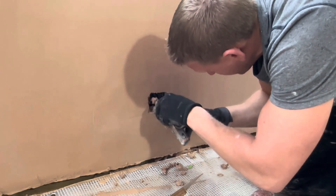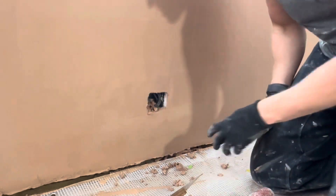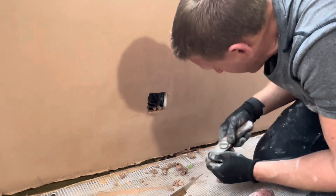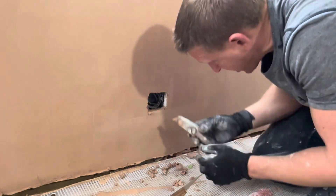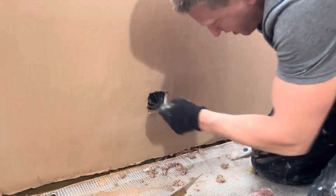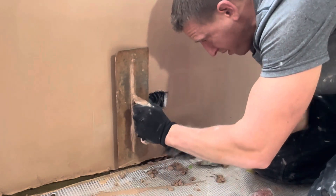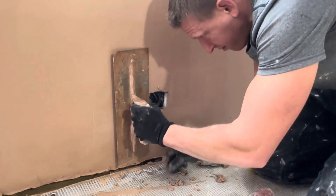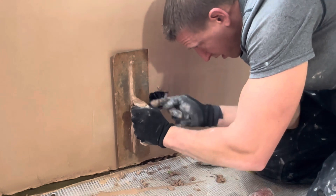I can hear that scrim — you can see it now. You can cut away; it's super easy to cut right now. If I'd left this until I'd finished, you can do it, but it's much more challenging — it's much harder, much stiffer. It would require a sharper, stronger knife or a bit more elbow grease, and if you crack it around the edges it's not as easy to fill. Whereas right now it's quite easy. I've just messed up the edge a little bit, so I put the trowel up, stuff it — fill the gap with this plaster, and then slide it off.